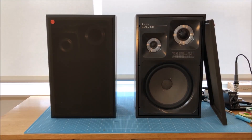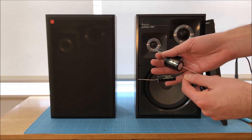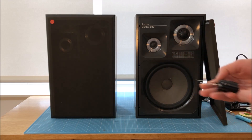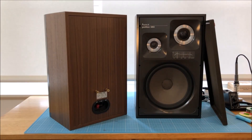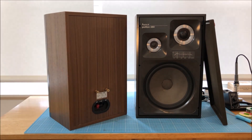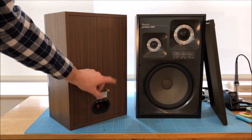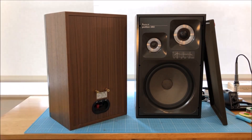In the first part of the video I'm going to renew the crossover by replacing all capacitors and the fuse. These are the new capacitors I bought. In the second part I'm going to show you how to upgrade the speakers with those speaker terminals here. I've already done that for one speaker. It is easier to use those as you can use banana plugs or thicker cables. This old mechanism is not very user friendly.